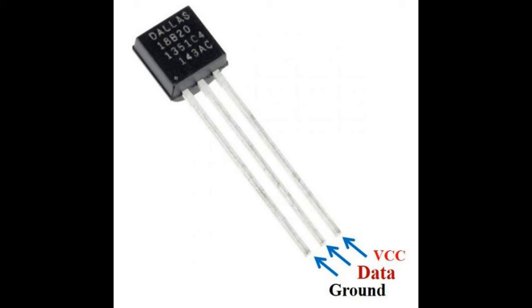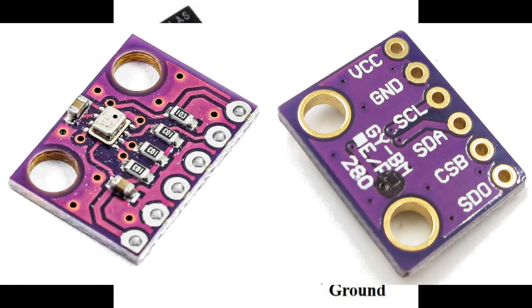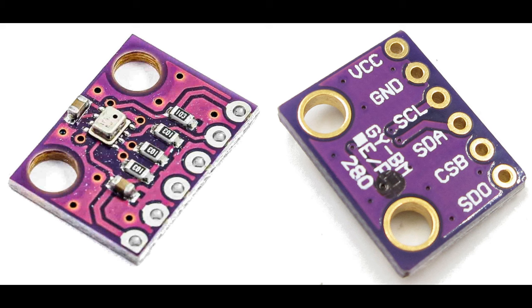Using only one such temperature sensor is not ideal, but at least this flickering affects only one side of the range's measurements, the other being calculated from the atmospheric pressure measurement, which is measured with much higher resolution. The BMP180 has an output resolution of 0.01 millibars, which gives about 6,000 counts over our range of interest.